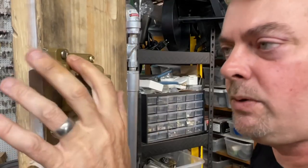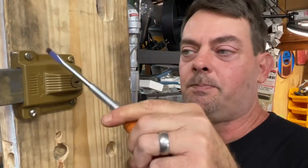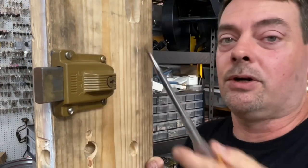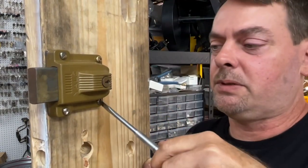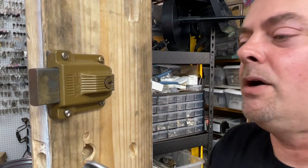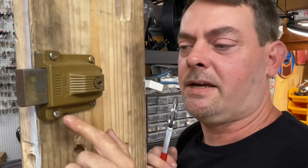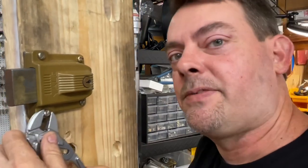On hollow metal doors, these came with four flat head and four security screws, so almost always you'll find a flat head or two on it. These were popular in the 70s and 80s. I would tighten down one screw first — what that does is it frees up those heads a little bit more. You may be able to use the security driver to get the screws the rest of the way off. We're going to fast forward through this part.